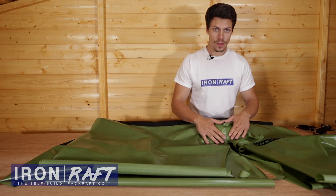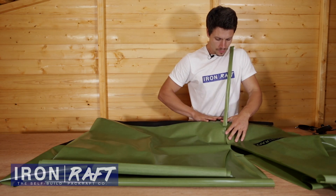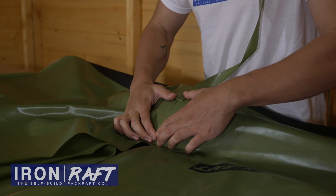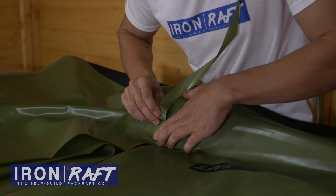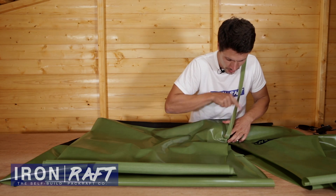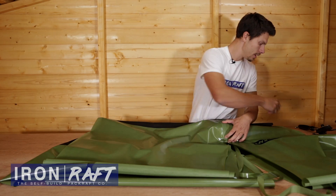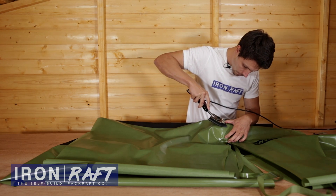I'm going to demonstrate the next section along — it's exactly the same as what I've just shown you. So get this out of the way over your shoulder, align this with the end of the bit we've just done just on the ridge. They're lined up, and you just want to take that down there keeping it central over your joint. Pin it with your finger, pinned at the top. Make sure it's straight. These are draped naturally where they want to be. Grab your iron and just work your way down sealing it.